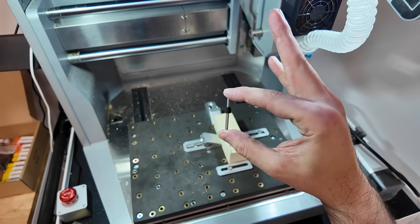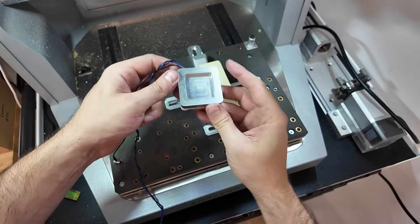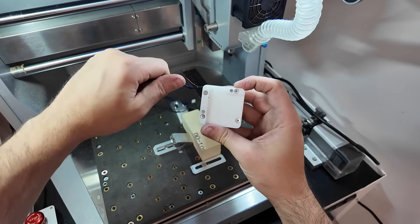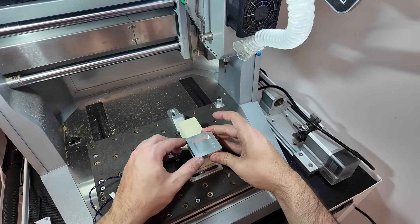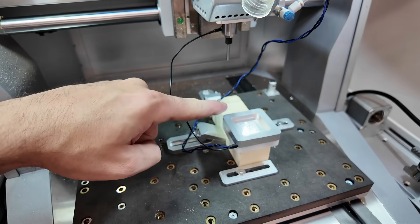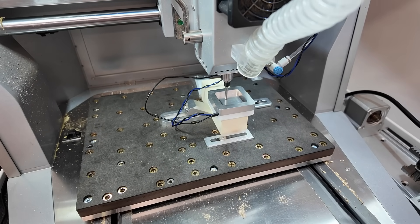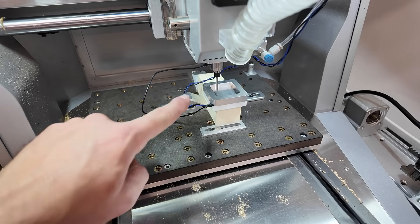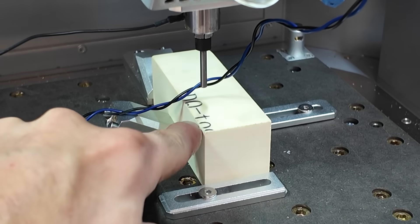The touch probe is the little placeholder that is shipped in the collet. This is our XYZ probe receiver — it's got a little magnet that attaches to the collet. It has a 90-degree corner that we line up with the origin point of the workpiece, and we take a little tape to secure that. We take the touch probe and line it up so it's inside and above. Now it's pointing directly at the origin of the workpiece and knows the height as well, so it knows to start machining right at that point.